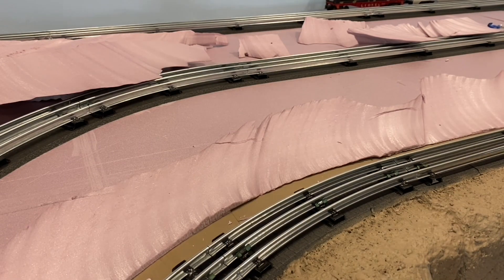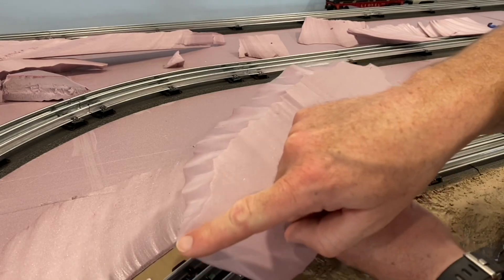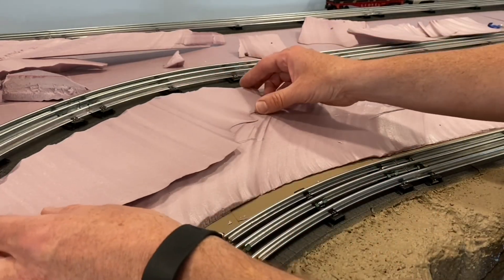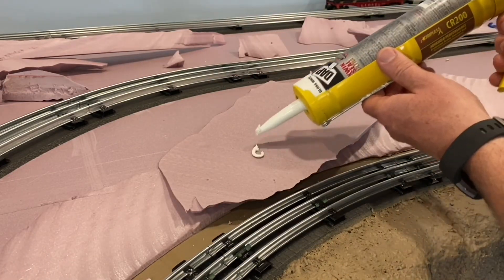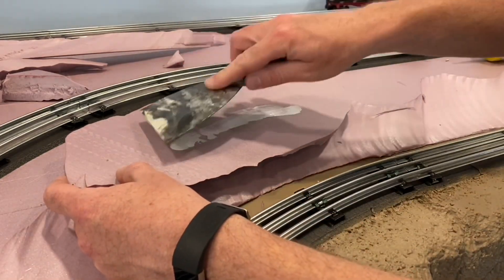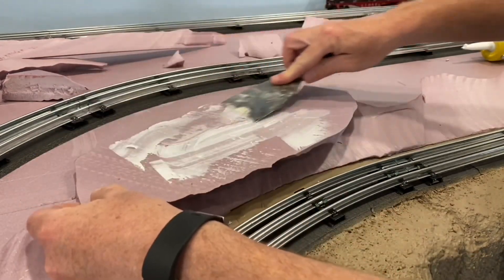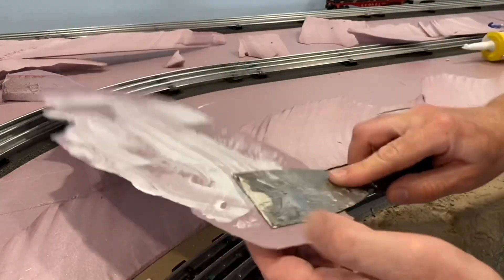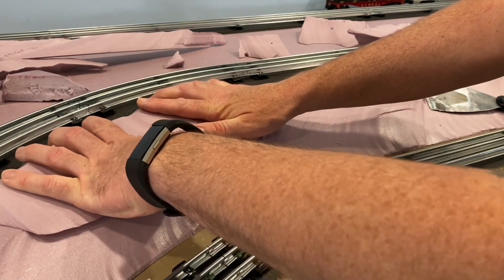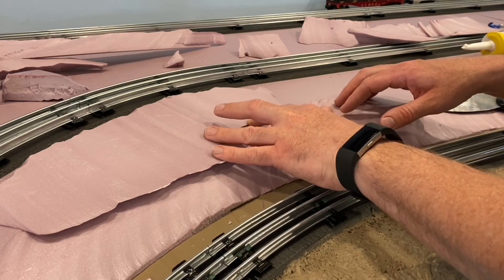What I'm going to do is take some of those pieces that came off. I think this piece came off down at a further corner. I've cut it already to be on an angle and roughly the shape of the curve up here. All I'm going to do is put some caulk on the bottom and spread it out with a spackle knife, then place it and slide it a little bit to get that caulk to really sit. Now you can see it's overhanging.